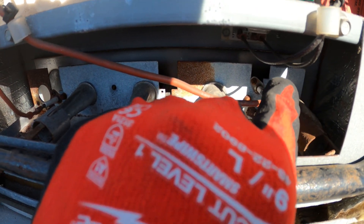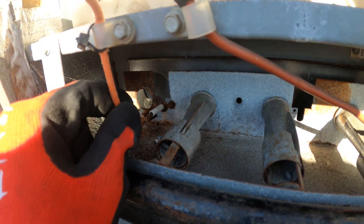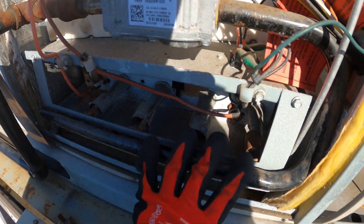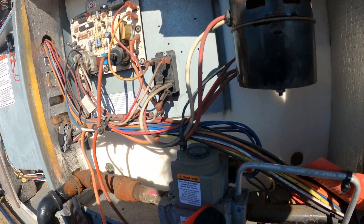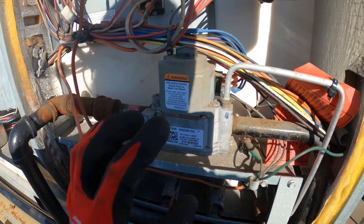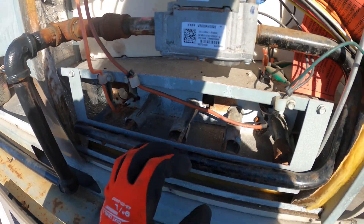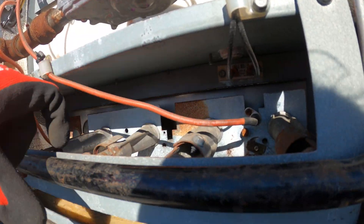Once this pilot tube has a flame and it goes all the way across, this is your flame sensor. It's sensing that we have fire, then it comes back to your ignition control and says we have a fire, so we're good on that end — we have air and we have fire. Next, this board is going to send voltage to the main gas valve solenoid, and that's going to open the main gas valve. You're going to hear a whoosh, and that whoosh is a much larger amount of gas being shot through this burner, and that's going to give us our flame — you're going to see flames coming out of your burners.